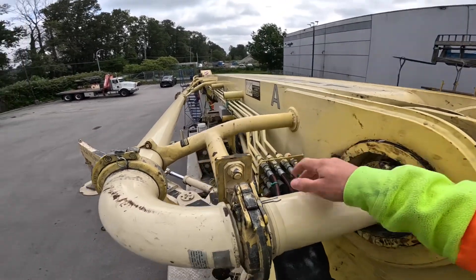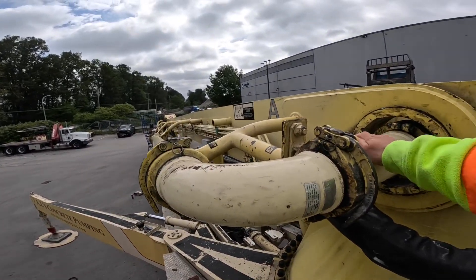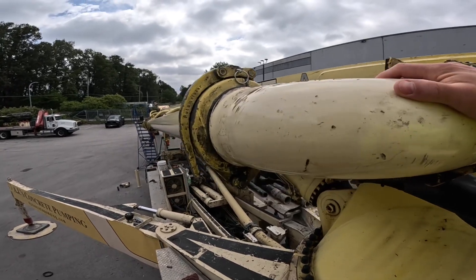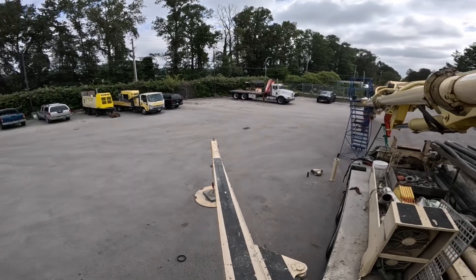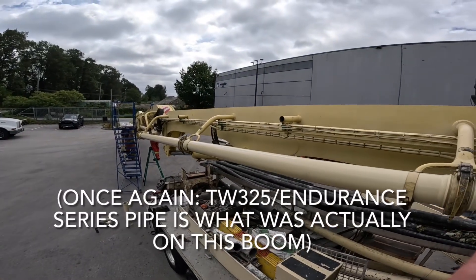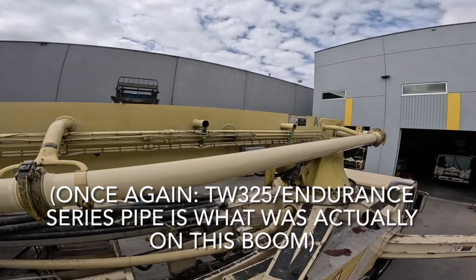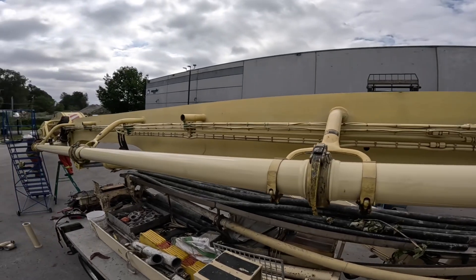So we went heavier with these two pipes. Everything else is Twinwall 275. These are Twinwall 275 elbows — a hardened steel liner instead of chrome carbide — and this is exactly what we had on this boom before. It has about 80,000 cubic meters through it. This pipe system has been on here for about five years.